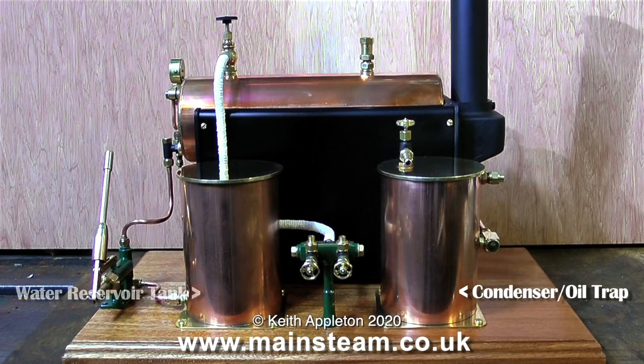On the left-hand side is the water reservoir tank. The procedure is to fill this tank with cold water, which can then be pumped into the boiler using the hand pump. The hand pump is a very simple device — it uses two ball valves, one on the inlet and one on the outlet. Generally speaking, these hand pumps need an extension handle. They're okay at atmospheric pressure, but if you're pumping against 60 pounds per square inch in the boiler it can become difficult — that's why you need the leverage of a hand pump handle.